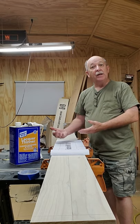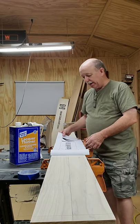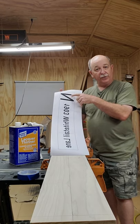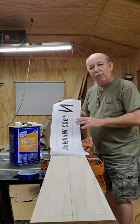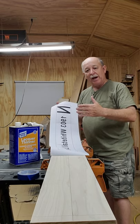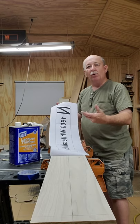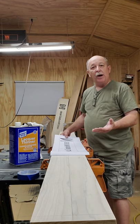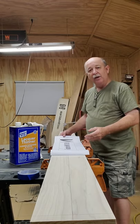You have to get the image laid down and lined up so it's in the right orientation. What I typically do is, when I draw out my images on my computer, I run a line down the center of the image so that I know what's the center, and then I draw a corresponding line down the center of my board. That way I can line those up and know everything is on center, top to bottom, perfectly where I want it to be. Then it's just a matter of shifting it forward or back, depending on what the board has — if there are any knots or whatever, you want to work around those so they're not involved with the image you're trying to transfer. In this instance I'm using poplar, so it's just grain structure — really pretty nice grain wood, so it's going to look good. All I really have to do is just line up my center lines and it'll be good to go.